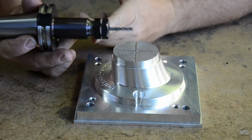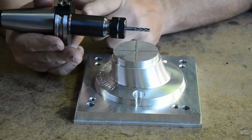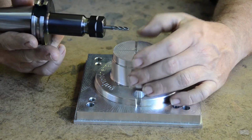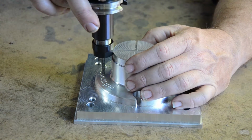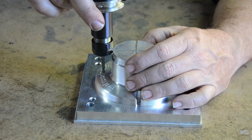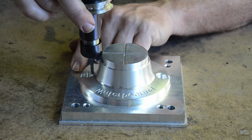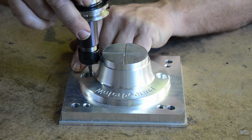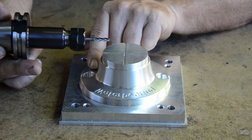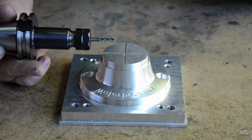So typically, the way I hold a part is with what's called a collet, and this is one of those holders. You've got the holder itself, you've got a nut that holds the collet in place, and then you've got a cutter. But this is really rather large in diameter. So if you wanted to get into something like this, you can't get in there. You can't get into the shoulder. And if you're, let's say, trying to mill this lettering, no, not going to happen. Also, the case here in this boss, you can't get at this. This nut hits the part, and when this thing's spinning at 7,500 or 5,000 RPM, that's bad news.